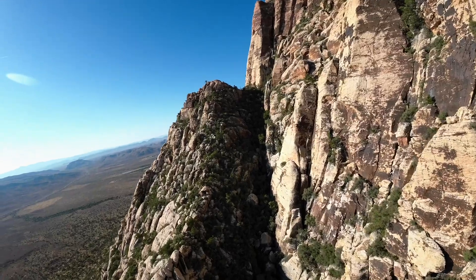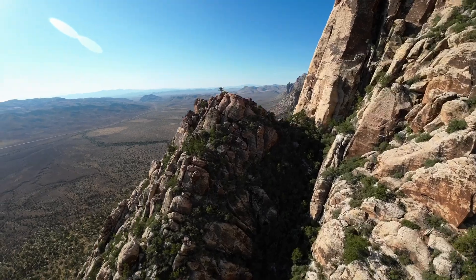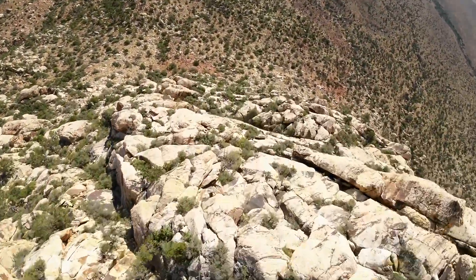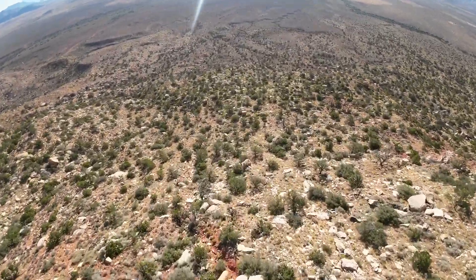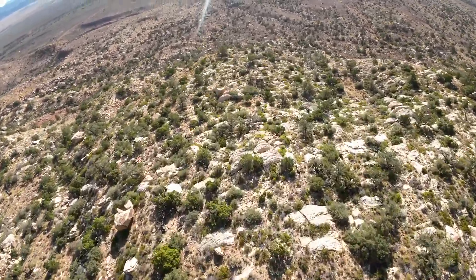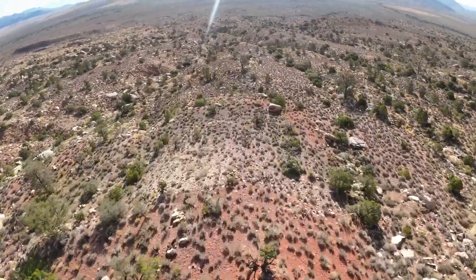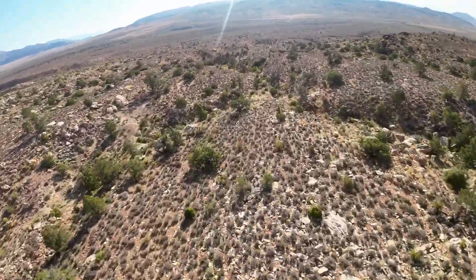The biggest con is the RTH altitude — you cannot adjust that like you could before you do the hack. So if you do have a disconnect, the drone will actually just stop right where it is and head back directly to home. If there are any obstacles between you and the drone, it's going to hit them — it's not going to rise up like it used to. Even freestyle drones have the ability in failsafe to adjust altitude so you can climb up above obstacles and make it back safely. That's probably the biggest drawback.